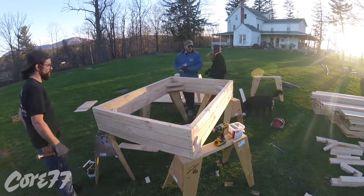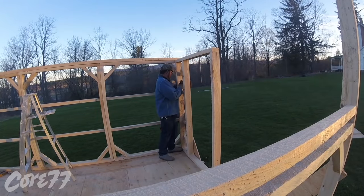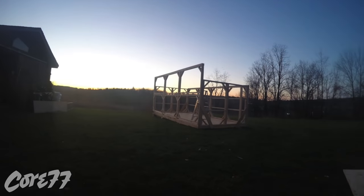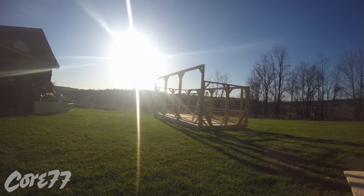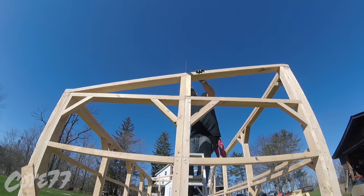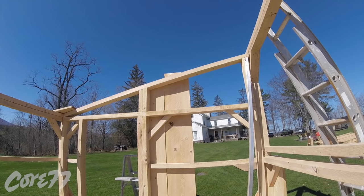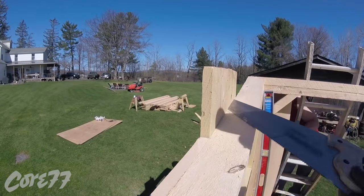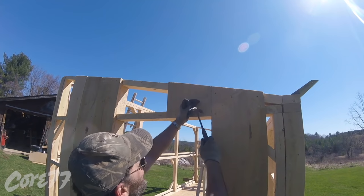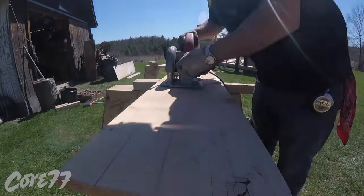One of those 4 sections gets a door built into it. You see the sun is going down on day 1 of the full build — that's going to be the section where the doorway is. This is sunrise on day 2 of the full build. There I'm putting in what's going to become the cap of the roof, or the roof line. I always build everything in place and then cut it in half, or build things in place and cut off the trim — just a habit of mine. I'm using the hand saw a lot on this project. I just make sure one end of the board is clean — that's where the bottom starts — then I put it up long and cut the top off. It's easier for me to just cut it in place.